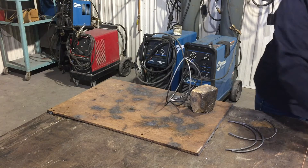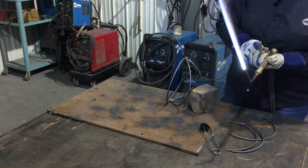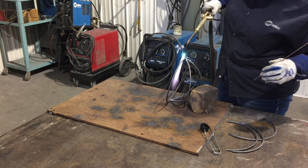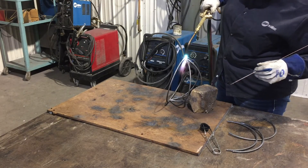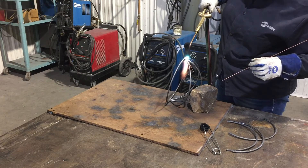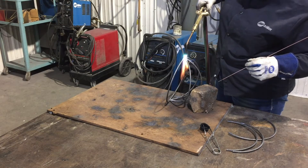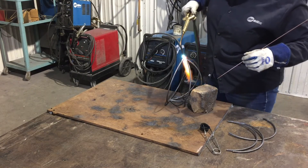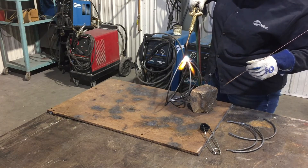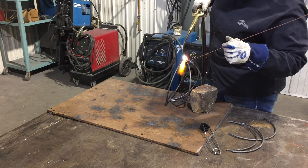Now at this point there are two directions I could go. The first would be to take the other side of the three arcs we've put on there, prop this sphere up on the fire brick, and weld that all together. However, if you really want to save time by using the heat that's already in the system, you can go ahead and put three arcs on the other half of the sphere, tacking and welding from the same point, and then flip the entire sphere over and do all of the other tacks at once. I'm just going to weld this other side right now — to keep this video short — and let you fill in how to do the other half based on what you've already learned.